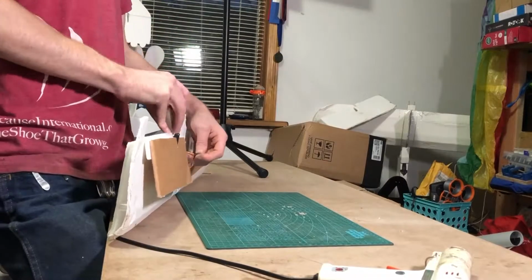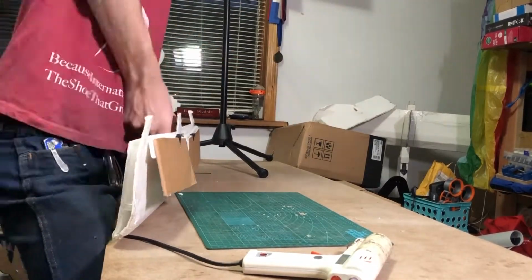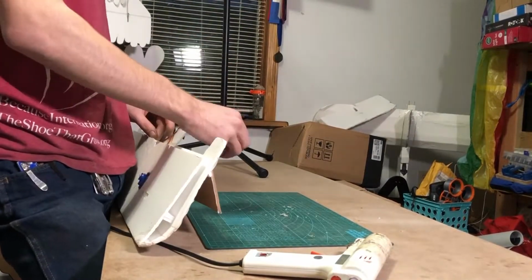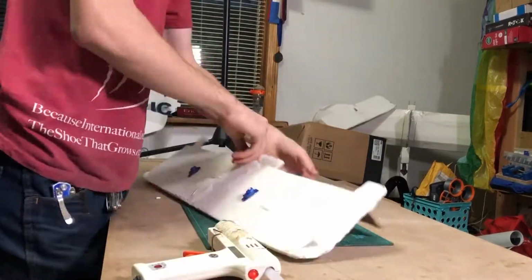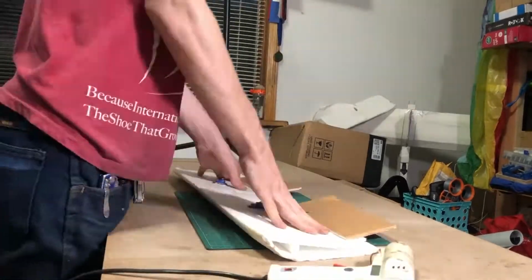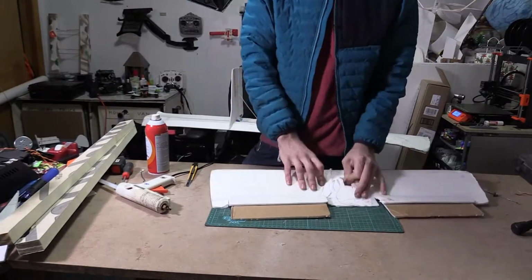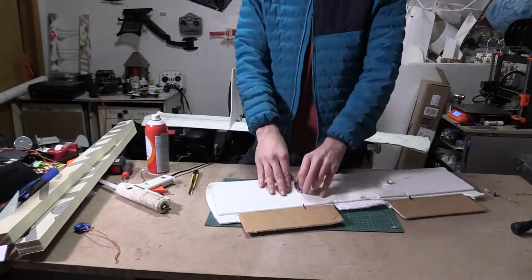After I had a pretty hard crash on this, I ended up going back and putting a wooden spar in there, because I decided that the front canard needs to be perfectly straight for the front elevator to work properly. Since it's so long, if there's any bend in it at all, it makes a bow shape, and the servo just isn't strong enough to compensate for that.